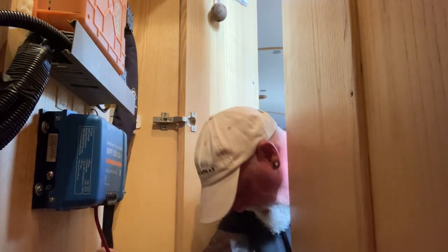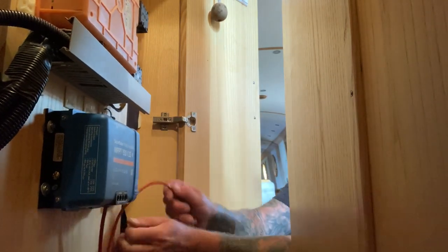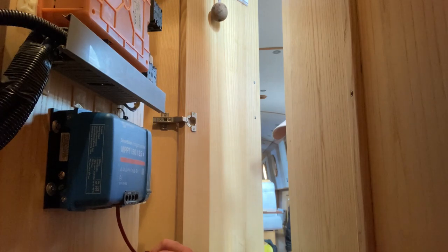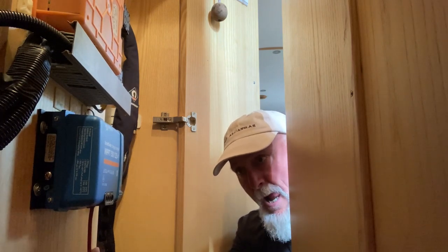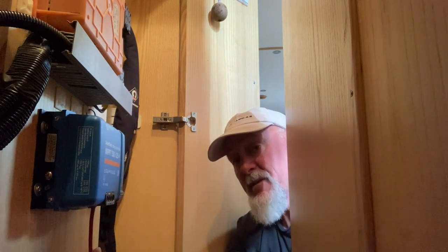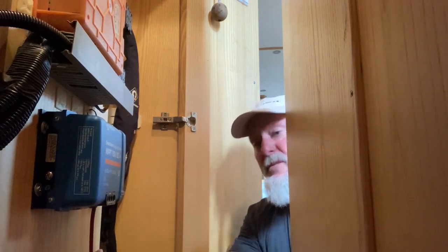Yeah, I was saying, solar cable is 6 mil, double insulated solar cable. And oddly, on this particular job, the cable going up for the charging circuit will also be 6 mil. Why 6 mil? Okay, it's only a short run. It's a 35 amp controller, so that's the maximum it could ever produce. 6 mil cable, single, is rated 42 amps. So that's okay over a short run. I'm not worried about volt drop, because it's only a foot or two.